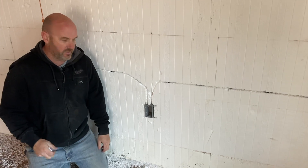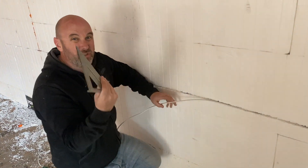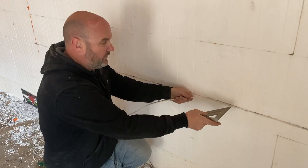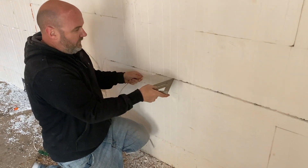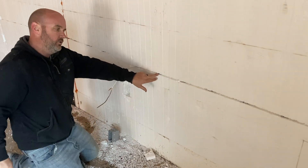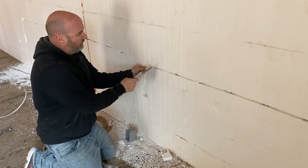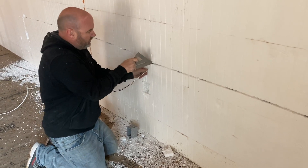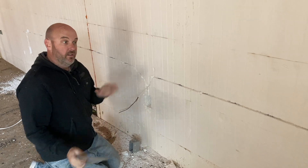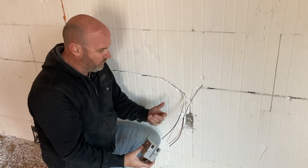I've got my groove here and I've got my 14-2 Romex. I'm in a bedroom, so I like to use a speed square to push the wire in. You can use a Sharpie, anything. I don't want to use anything sharp like a flathead screwdriver because I don't want to damage the Romex. You can just slide it back in there — that's going plenty far back to be behind any screws that you might drive into the wall. And there's no web right there, so you wouldn't catch anything to get to the wire. I'll leave it hanging out just a little bit, then put the box on, slide the whole thing in, and move on to the next box. The wire runs both directions — this bedroom is just daisy-chained from one to the other.